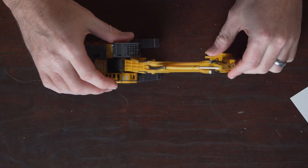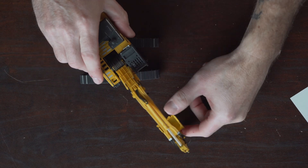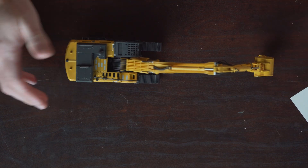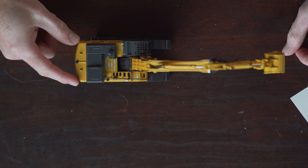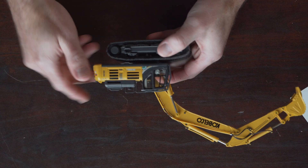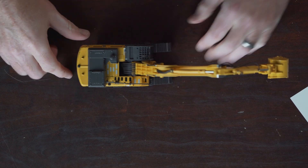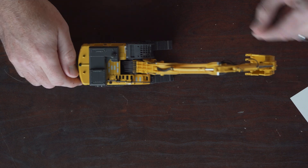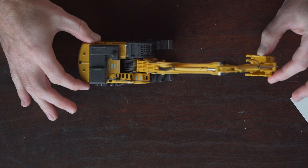Everyone's familiar that this thing picks up a lot of dirt, it spins it around, and it throws the dirt. Now this thing, in theory when you first get into it, is super stable and you don't have to worry about it bucking and pitching — and very quickly you're shocked when that is not the case. The way an excavator works is basically like a giant teeter-totter. We raise our boom up, we have a counterweight back here — it's the heaviest single piece of the machine — and then we also have our final drives back here which add a fair amount of weight to the back of the machine.